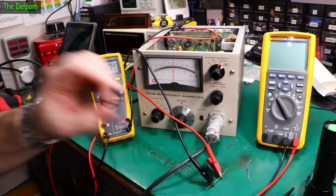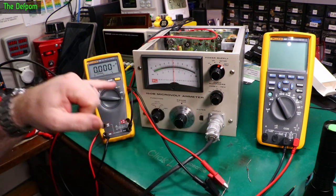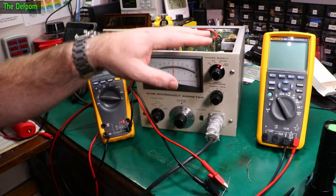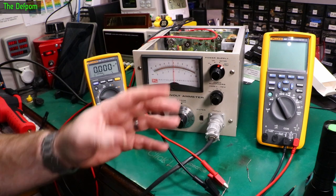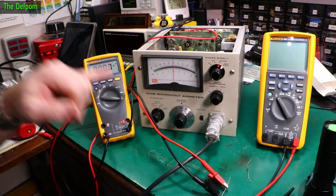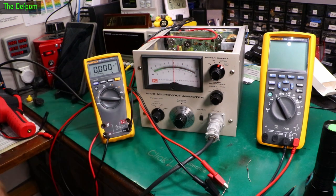It doesn't like that. So if I've got a 24 volt Zener here, that draws about 100 milliamps instead, which is doing a lot better. The resistor's running colder, about 70 degrees. The diodes are down to just below 50, which is a lot better. Still a bit on the high side, but tolerable. That's okay. It could be nicer. But that says 100 milliamps is like the largest current we want to draw through this thing. Now, if I can do less than that, it's even better.